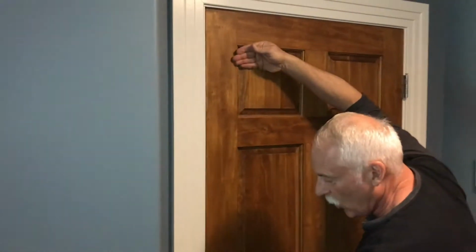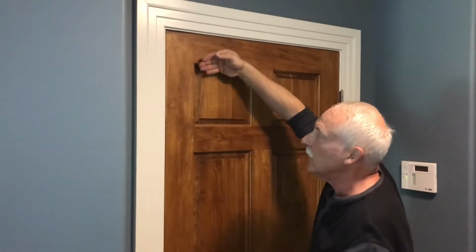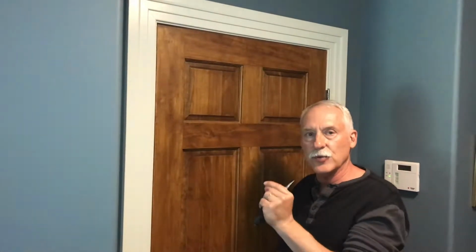And yet as we follow down, we see that there's quite a bit of margin here, up to almost 1/4 of an inch. What has happened is the door has sagged down because people have hung on it. They open the door, and that causes the door to gradually go down. The reason for it is on the hinges, on interior doors, they only use a 3/4 inch screw. Let's see if we can't fix it.